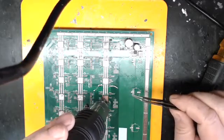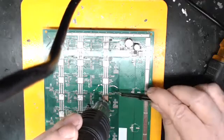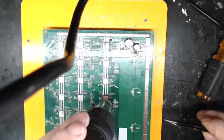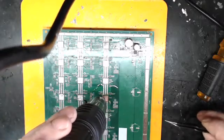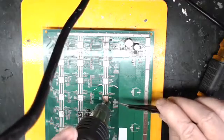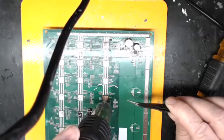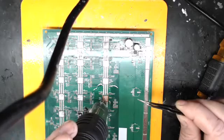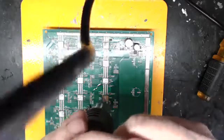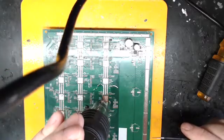I see some good things happening here, I'll just keep warming this up and try to reseat this chip again. The other side that you can't see — I can see it starting to poke out and be shiny and melting. Let's keep circulating the gun around here. I can see a little bright spot there, even the resistor area getting a little bright. Still some dullness around here. I want to get everything good and melted and then put the chip back down. I see it boiling and the chip spitting out some more flux — I think that's a good sign. If there was too much flux on the base, the chip can't sit down enough.